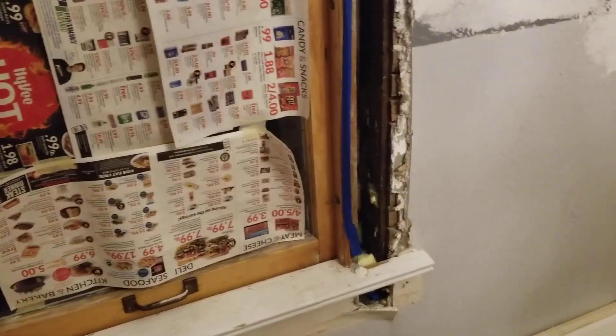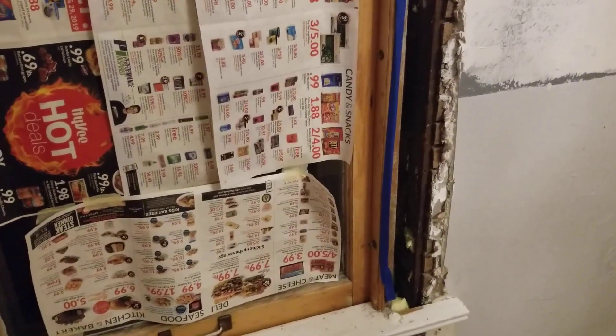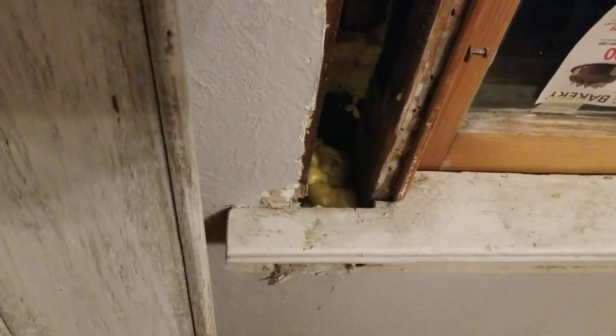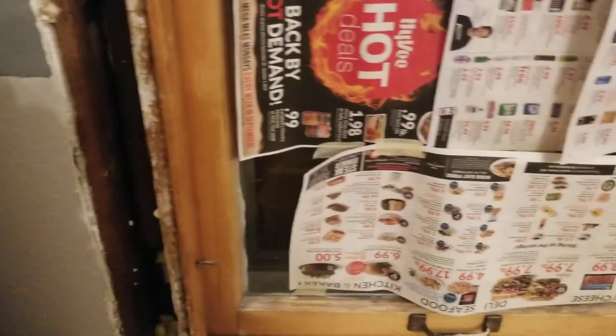Well, that was just an update, short video, just to let you know one more step to do. And I think that's the final step for insulating. So when you do the insulation like the other video: you fill in all the big voids with spray foam, all the small cracks and stuff with caulking. You can pack your upper where there's no ropes or anything, and pack a little bit at the bottom — just enough to get the weights through the weight pocket when you do it. It doesn't have to be very thick, just a little bit. Then drill holes and spray foam the voids around the window.